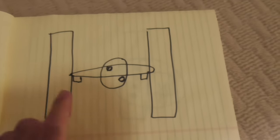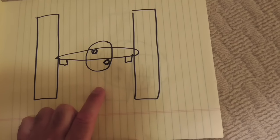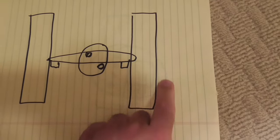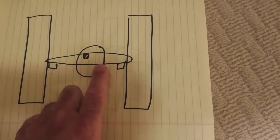Hopefully this is going to make some sense to you. Imagine that you were looking into the ceiling. This is a 4-inch hole that you've drilled into the ceiling. You can buy a hole saw if you need to, or you can do that with a drywall saw. Imagine these are two studs. You can go down to a place like HD and buy an adjustable fan support rod.